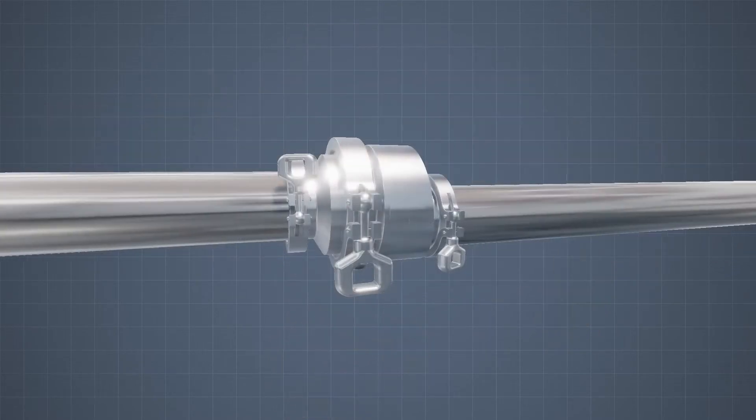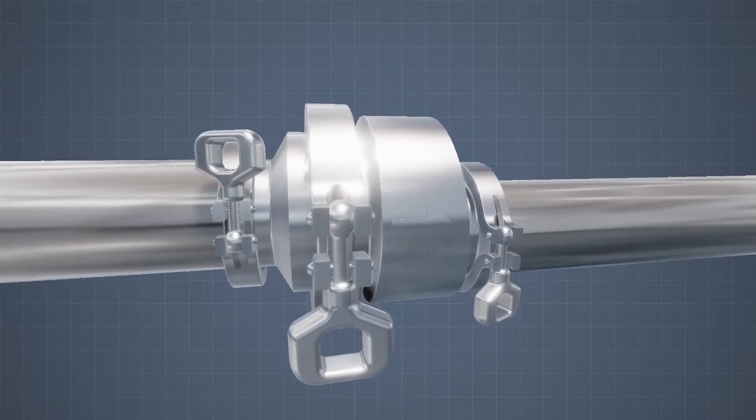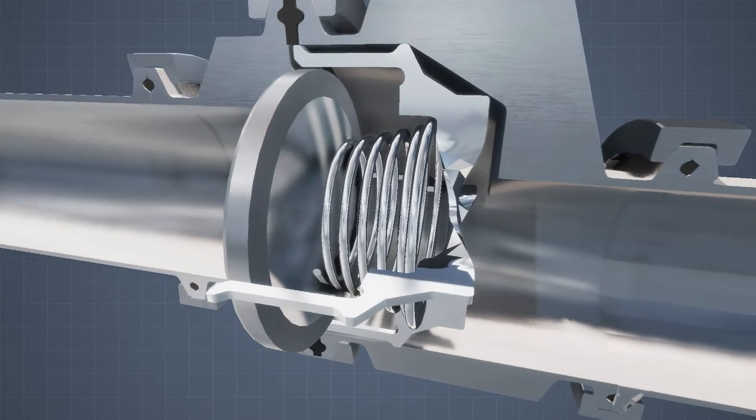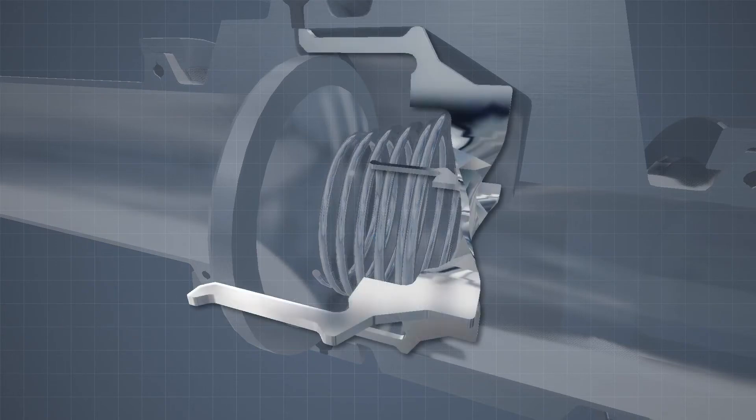An optional 25 RA finish is available, or 15 RA when electro-polished materials are requested. All DSV internals are 15 RA. The conical spring is 316L stainless steel with a 15 RA finish. The disc guide is 15 RA and precision designed for smooth disc closure.